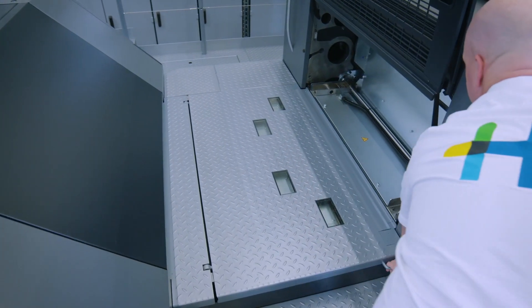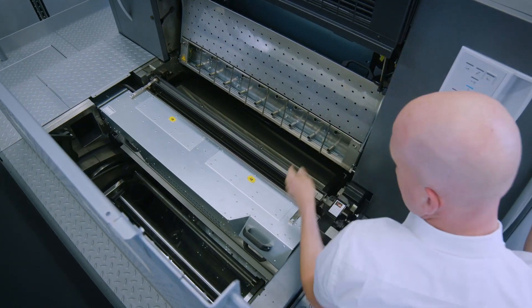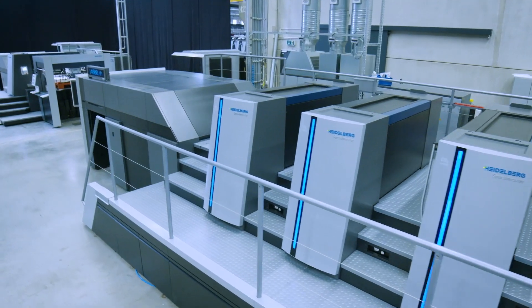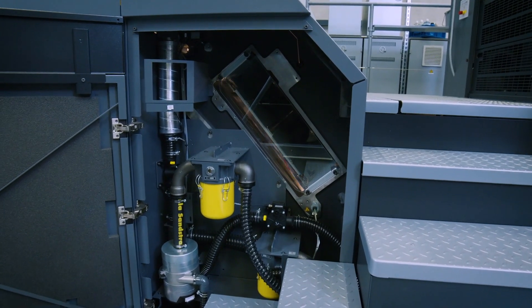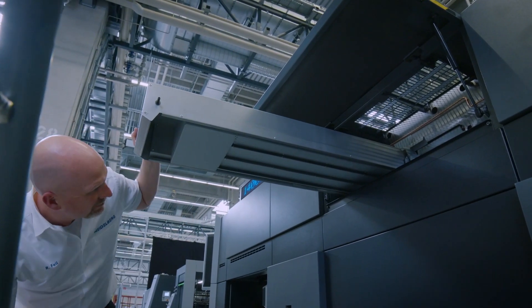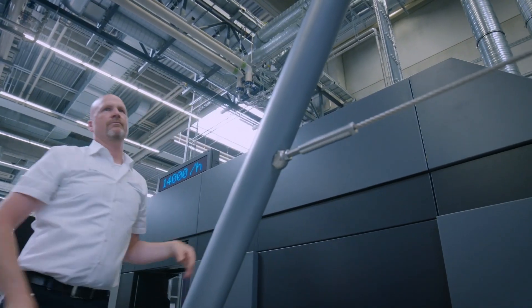We now have three additional Y-units building an extended drying section. Ten hot air and infrared dryers are integrated into these three units to optimize the drying process. The extended drying section and the reduced distance from the dryer to the substrate increase the dryer performance. In the delivery, the sheets are stabilized after drying and transported safely onto the pile. To prevent disruptions in the sheet travel, additional anti-static devices are installed after the final drying unit. Additional auxiliary grippers for maximum format size and the PowderStar AP500-DU with CleanStar slide-ins ensure that sheets are transported smoothly and safely onto the pile.